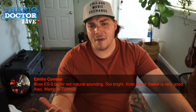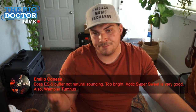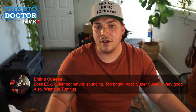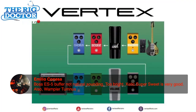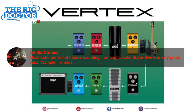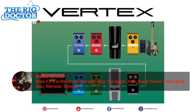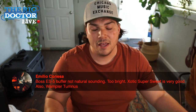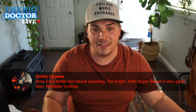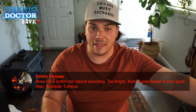Now, it may not matter if that was an input buffer so much, because if it's only driving a couple of cables before something's turned on, that may be a very negligible difference. But if this were the last one, like the buffer between the reverb and the amplifier in our fictitious buffer system, that's where you'd run into problems, because the longer the cable it sees on the output, the more unstable it becomes. And it's already unstable at 1K. That's not an optimal range to be running any sort of capacitance on the output.